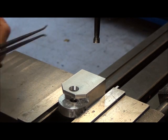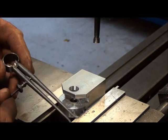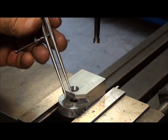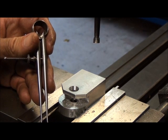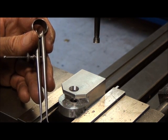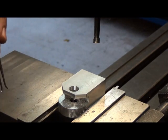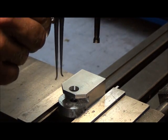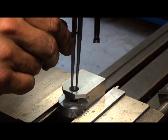One of the old school methods is to simply use a pair of inside calipers. These are generally used for rough measurements, non-critical measurements, but with a little bit of care and a little bit of practice, they can be used to measure quite tight holes. Let's just try it on this hole and see where we're at, just as somewhere to start.